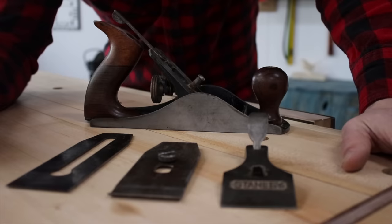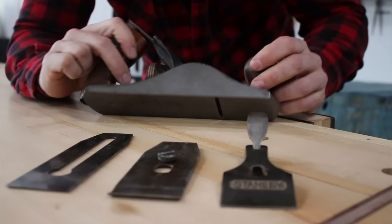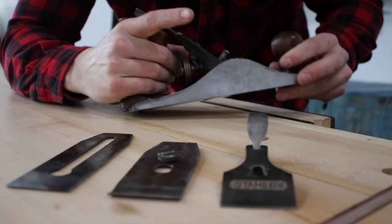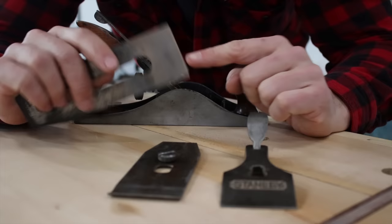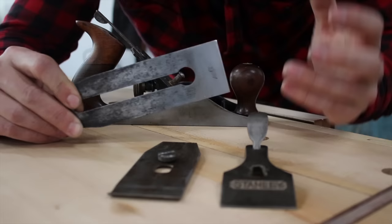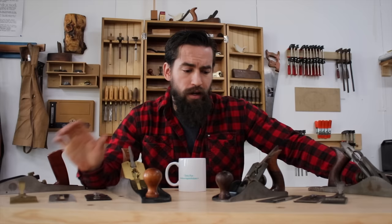So let's say I'm in the market for an old Stanley — what am I looking for to make sure I don't get a lemon? First, I look at the casting: I want to make sure there's no crack up the side or along the mouth. I also check whether the handle has been repaired — that's workable, it's really just a comfort issue. Lastly, I make sure none of the components are severely pitted and rusted. A blade with severe pitting on the back side will prevent me from getting a sharp edge, and since we're buying old Stanleys to save money, replacing the iron doesn't really make sense.